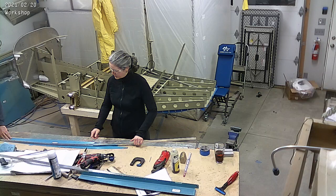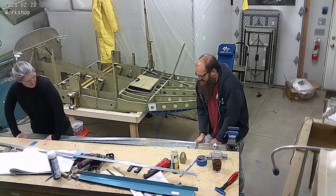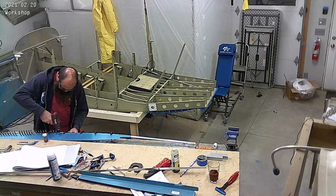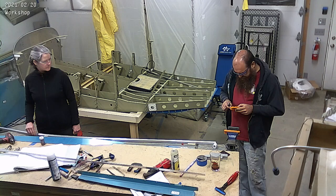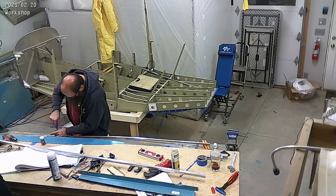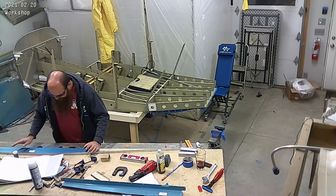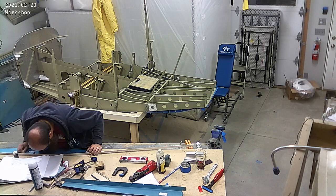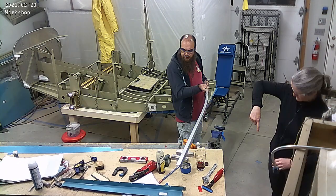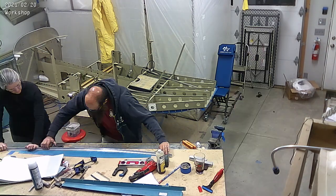You can see that big bend right there — it used to be straight, now it's curved. It fits the template, and then you drill a bunch of holes and there's the twist. You can see we clamped it, I put a wrench on it, twisted it, and then you measure it. I used the iPhone angle measuring tool, which actually worked really well for this, to figure out the angle. There's a lot of trial and error here.